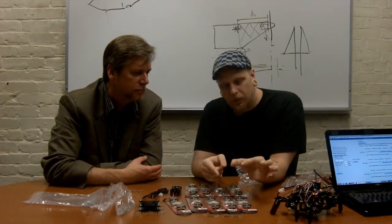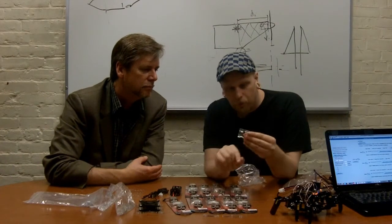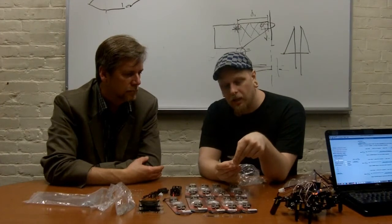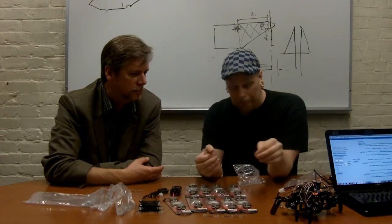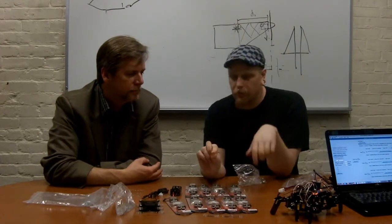The shoulder consists of two more pieces: the top plate, which allows the stand-up servo to go into, and the bottom plate, which has the mating holes for the bolts to go all the way through. Those two slots are what actually hold the servo upright. The bolts in the kit go straight through the bottom and top, and then the final stand-up servo sits in this little slot up here. You get a screw to go in and bolt it down.